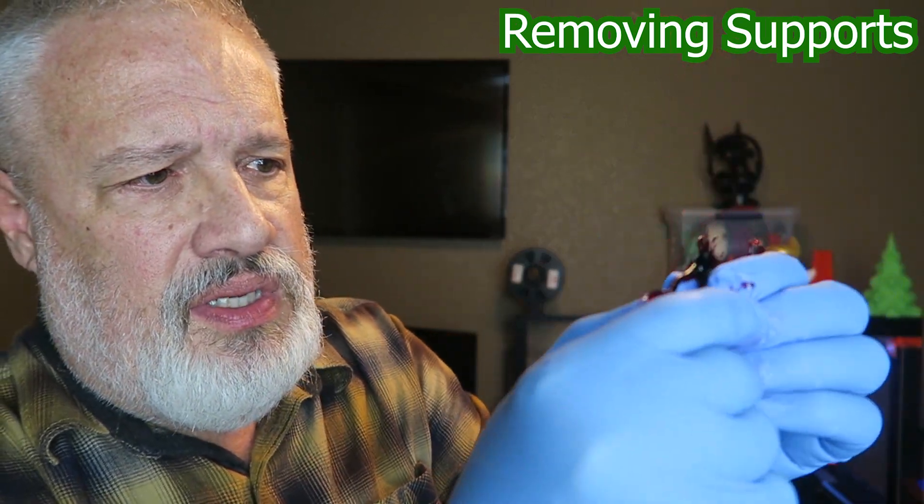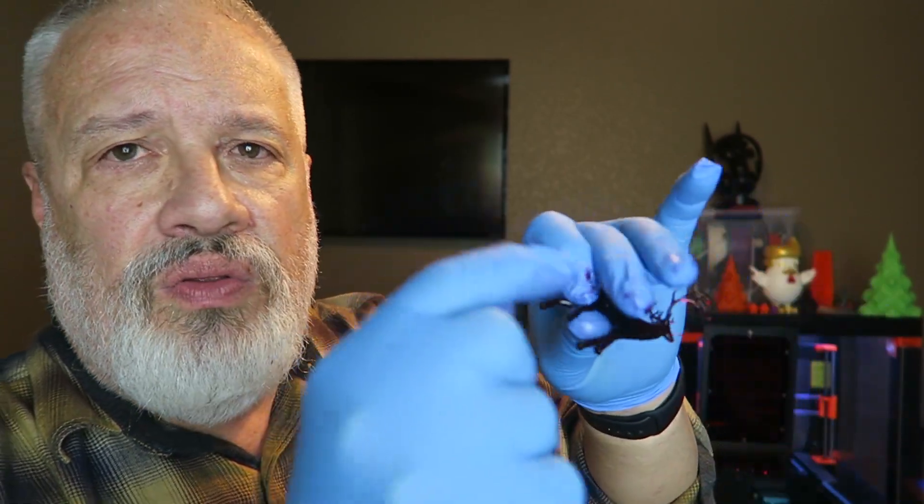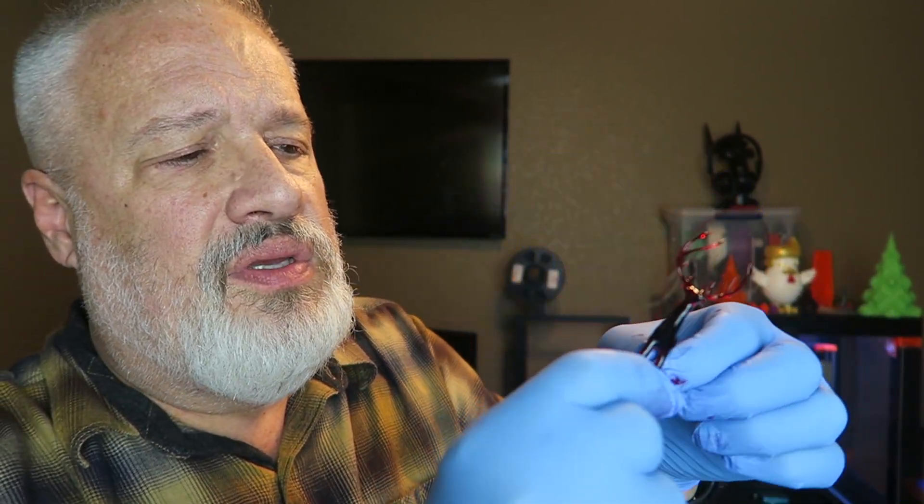Here's the next one. I can just kind of get my thumbnail under there, support the legs. Especially if you've got some delicate pieces, you may want to use some nippers or clippers. But I found out that just using your nail through your glove works well. When this resin is in this state — it's not been cured in alcohol, it's not been cured under the UV light — it's very pliable, and you can pop it right off. I like to do that with my prints.